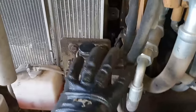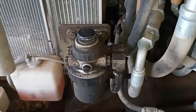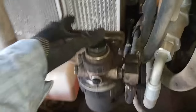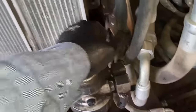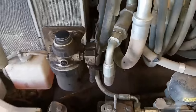The thing that's weird is this area is awfully dirty. Like, if you look at everything else it's just got dirt on it — it's like this is leaking fuel or something. That was plastic cracks and the lines. Here's something interesting — this is the priming pump, the hand-priming pump. It's running okay, this thing doesn't push a lot of fuel, but it can prime it. It's like it's sucking air. So we're going to troubleshoot that.